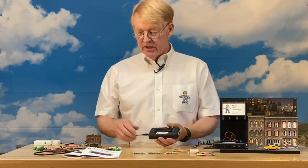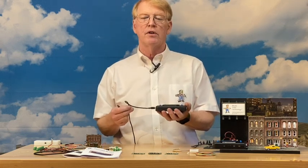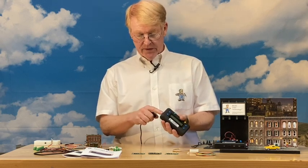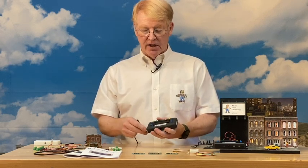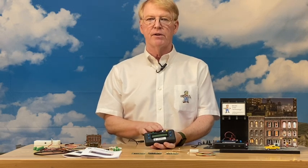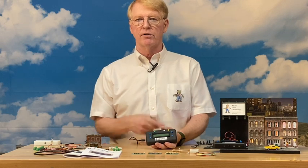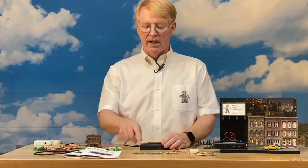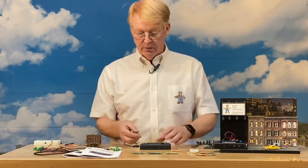The main unit comes with an 18-volt power supply, and you can use anywhere from 12 to 18 volts. There's an adapter plug if you want to run it off a different 12-volt supply. You can go up to two amps on the unit, which means you can now run LED strips off the ports — we beefed up the per-port power output. The same is true on the micro boards: they also support up to two amps, which is enormous if you're running LEDs.